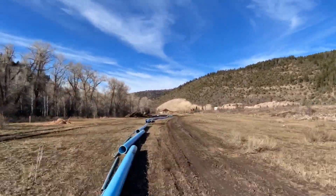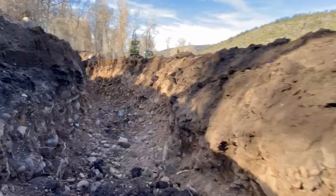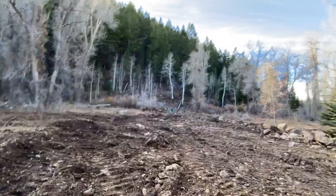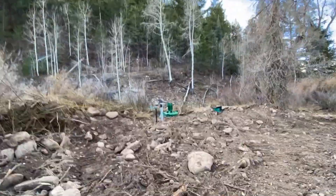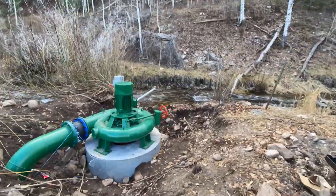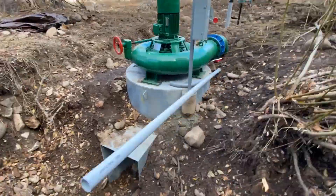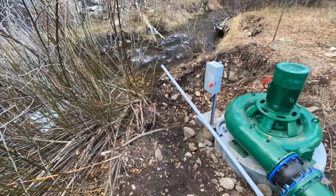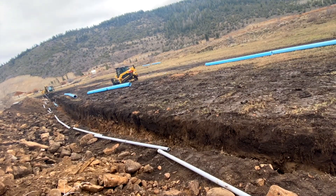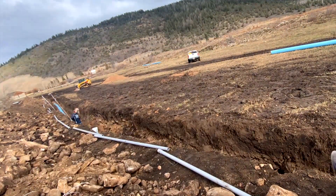A transition is made to the blue higher pressure-rated pipe, and we proceed to the ditch where it will be buried. Further on, we see the blue and red warning tapes, and eventually come to the end of the penstock, where again we have a 12 inch valve control and a vertical pipe leading to the drain valve. The electrical conduit is exposed so that the wiring can be pulled via a fish tape at a later date. The lion's share of effort and expenditure is involved in constructing the 1230 feet of penstock. Care in its placement will ensure that it never needs to be repaired.